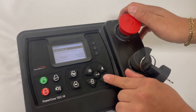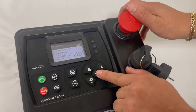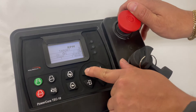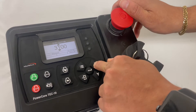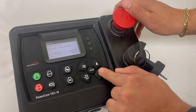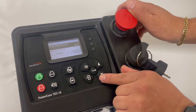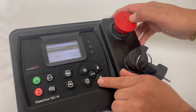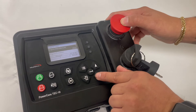You also have a couple of menu options for your engine settings. From here, you can select your engine type — whether we are J1939 or mechanical. You can select your engine manufacturer, and once you select your engine manufacturer, this controller will do an auto-configuration so you can get started and have your engine up and running, depending on your manufacturer.